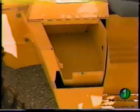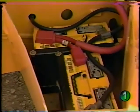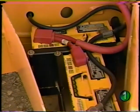Before we move on to the other daily service checks, let's look at the battery. We can see the battery with the toolbox removed. When charging or removing the battery or batteries, disconnect the ground or negative cables first. This helps prevent damage to the electrical components and lessens the potential for sparks that could ignite battery gases.